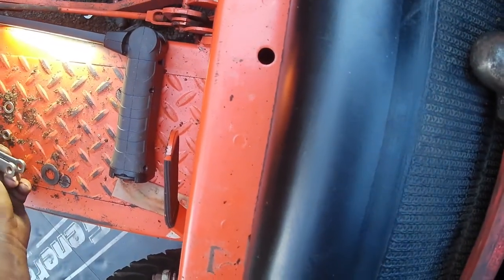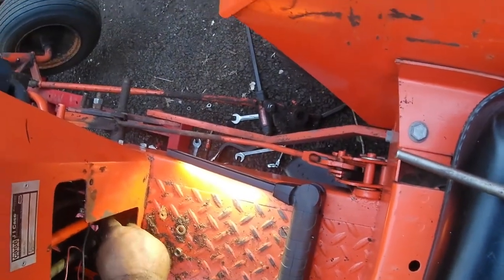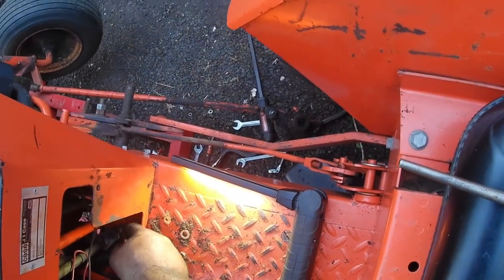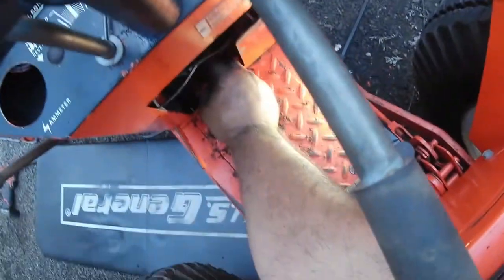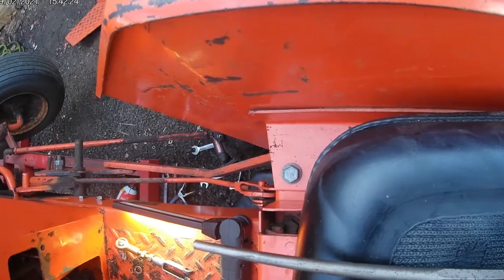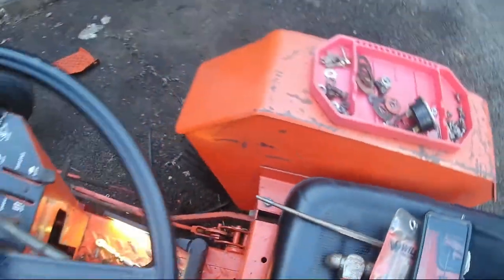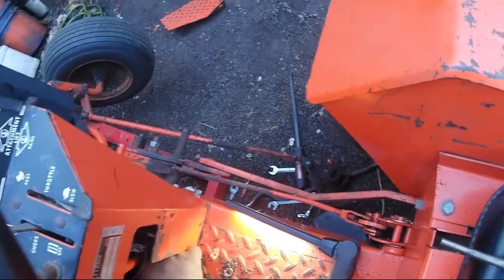Sometimes this hole is pretty worn out. We give you a little bigger size stud on this end than what this hole out of the factory is. You may have to ream this out with a file, drill bit, Dremel tool, die grinder, whatever have you. Or a lot of times it will drop right through because they're so worn. This one's going to have to get worked a little bit. As you can see, it won't go in. We'll just have to open that up to 5/16. I'm going to take this and try to get it as straight as you can. There we go. I said open it up a little bit.